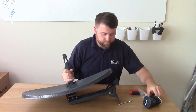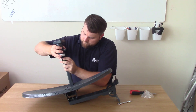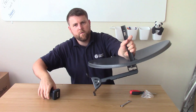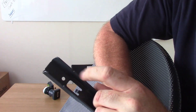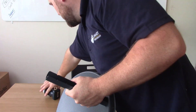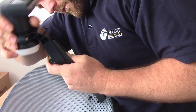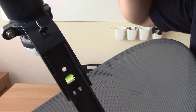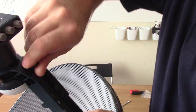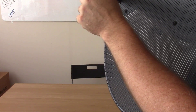And the last thing to put on is the LNB. This is just an old quad LNB with the special holder. There's two little grooves here, and there's another thing there. What the LNB bracket does is it pops under that and then clips in place around those two grooves - you see that. So those two little grooves are filled by that. And the last thing you want to do is on this bit here, which comes with the LNB - take that off and pop it in. You don't have to put this in, but it goes into there, into there, like that.